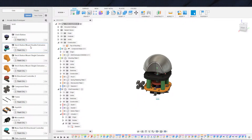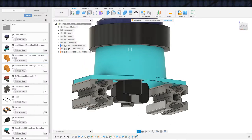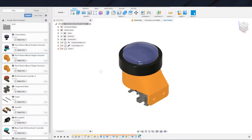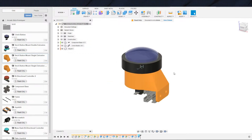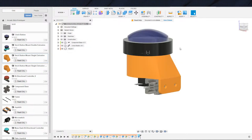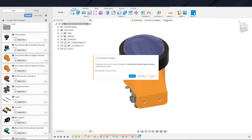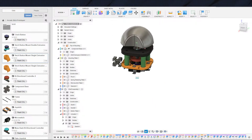So over here, we have two different examples. We have this 3-inch button across two extrusions. I found out that really wasn't necessary and went down to one extrusion right here, and Fusion has decided that we're going to go very matte on the preview. So that's fascinating. Anyway, point being is that over here on these ones, I could hit this guy pretty hard and it doesn't actually matter. However, I don't think we're going to try to get away with the joystick on just one extrusion. I think we will go ahead and use two extrusions.